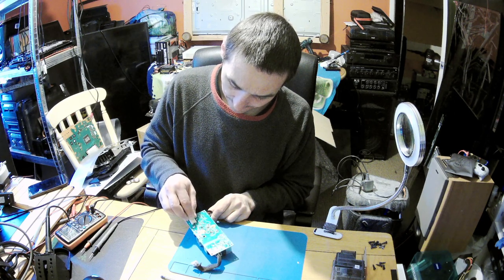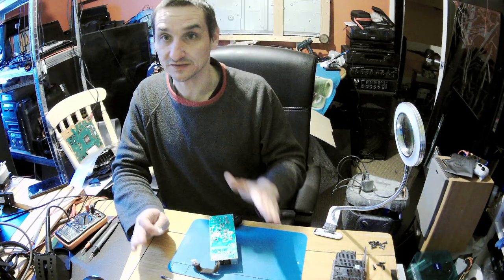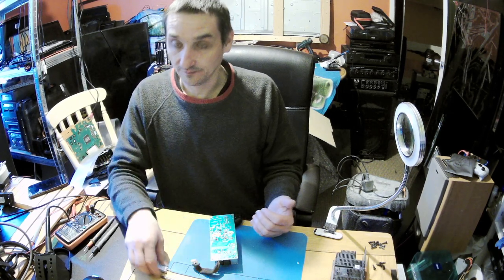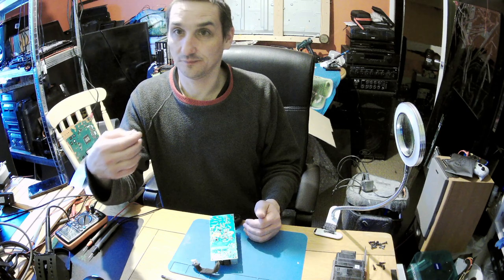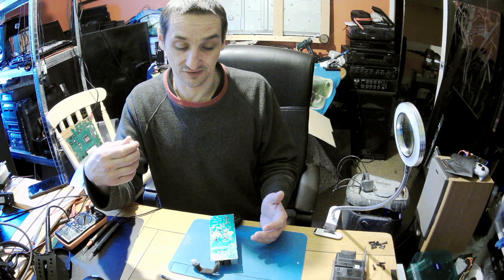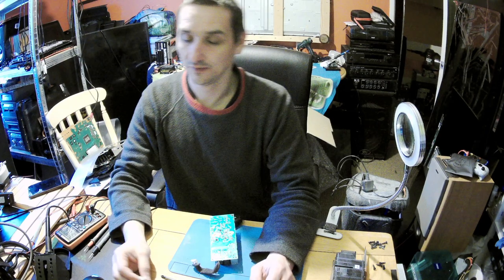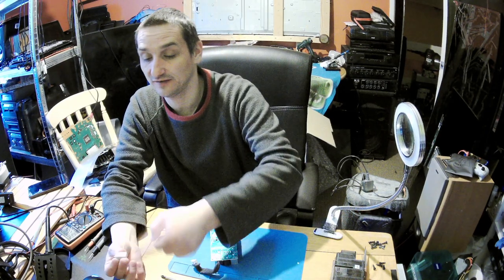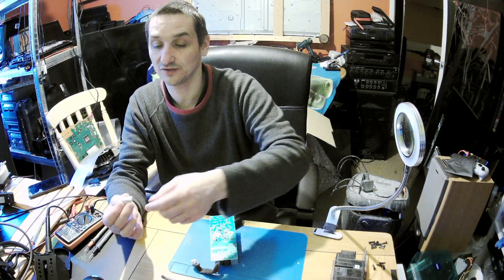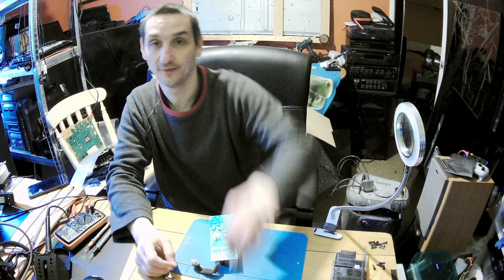Okay. Of the mains, and it's discharged, so it's fine. Now, when you work with high power devices, better don't work on them unless you are really careful and don't touch stuff. You've got 5 watts, 100 ohms, or two of them, you can as well. If they've got ends on these sides, you can twist them together or solder them and insulate them, and then touch like that.